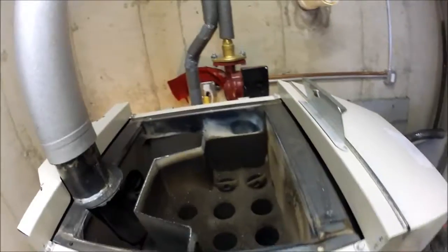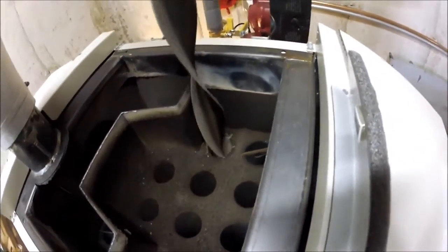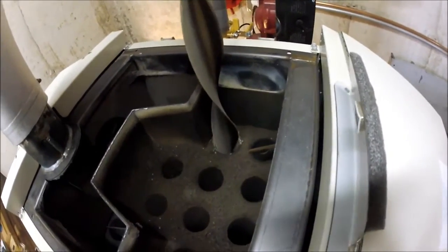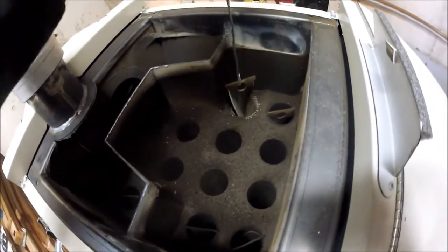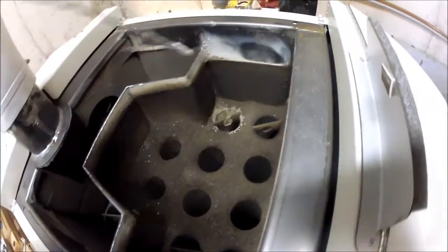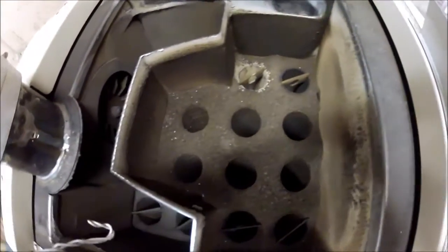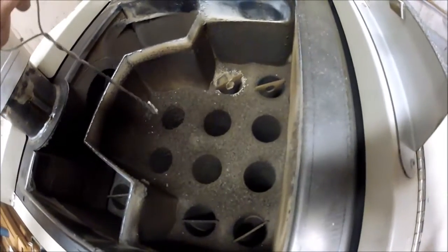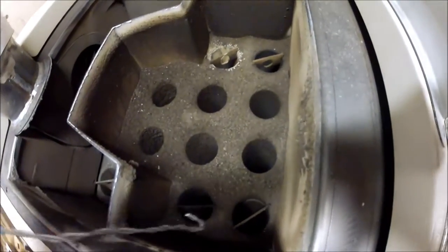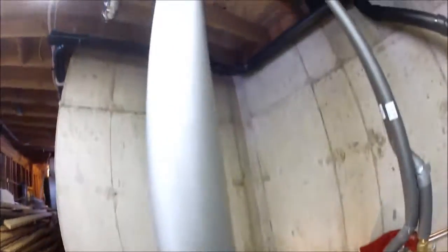I made myself a little hook to pull these things up — that cleans the tubes. You've got to clean them all. These six in the middle probably need to stay open because that's where the most heat comes up after it burns. Then it goes back down these tubes, comes back up these tubes over here, and gets sucked out the blower. Then finally it goes out.